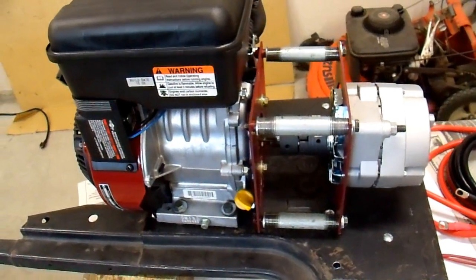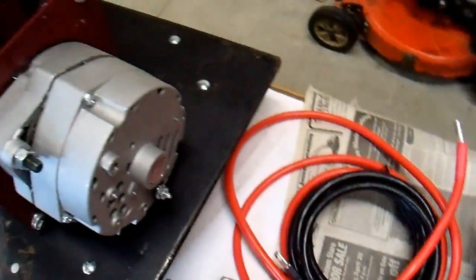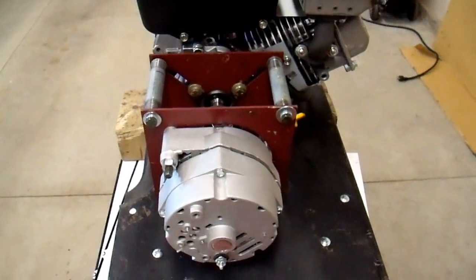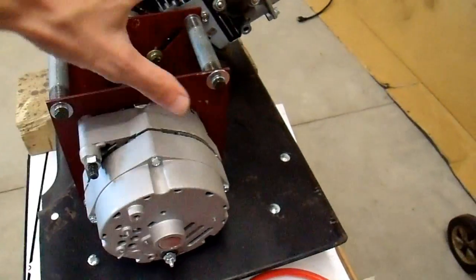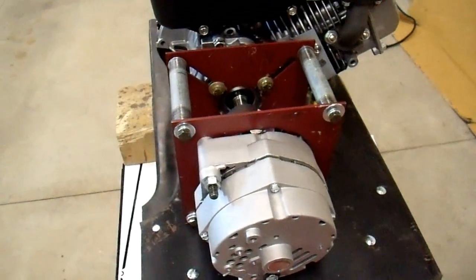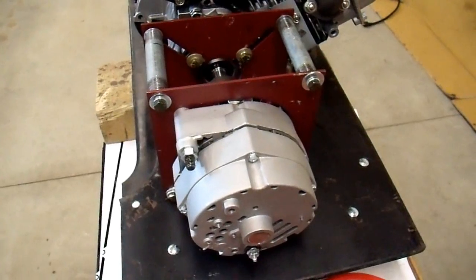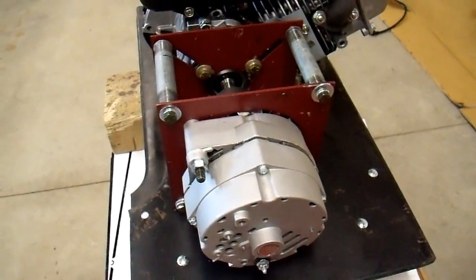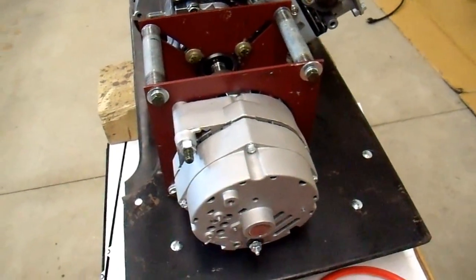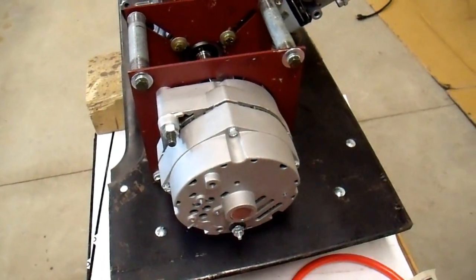The basic mechanical setup is done, and now it's time for the electrical portion of it. A lot of people like to put their battery directly onto the platform that the generator is on. I don't like that approach because these things tend to vibrate a lot. No matter how smooth the small engine you get, it's still going to have a lot of vibration compared to what a vehicle would have, and batteries are not designed for that sort of vibration. So they don't last nearly as long, they tend to drool acid all over the place, and it just gets really messy. I want my battery somewhere nice and stable on the ground, and I'll connect and disconnect it each time I use this setup.